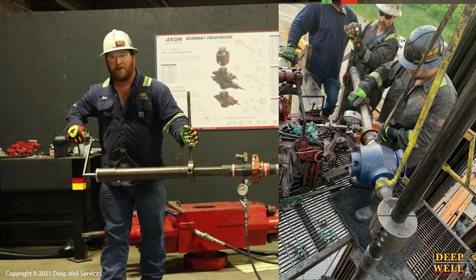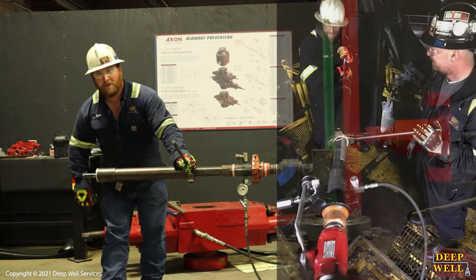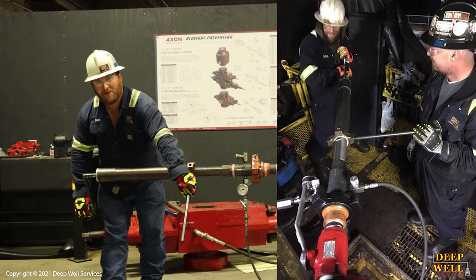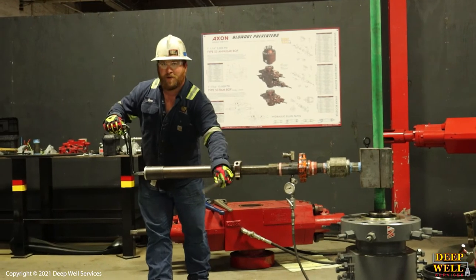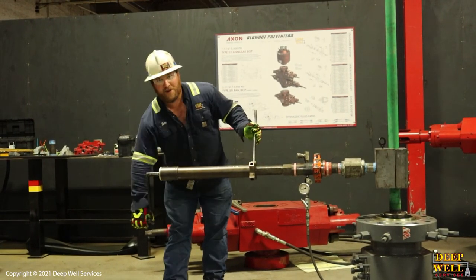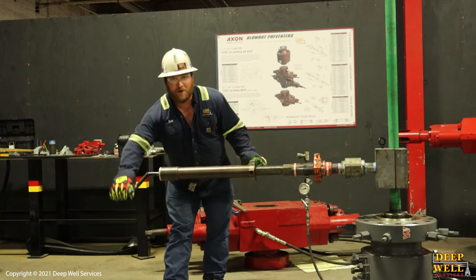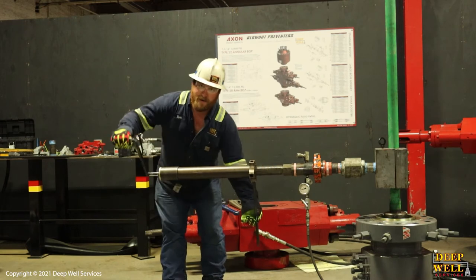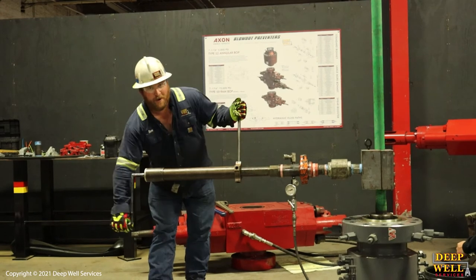For example: if I'm drilling nicely, I'll call 'give me some more' and the other person advances the drill. If the drill gets too tight, the person running the drill bit needs to call out to stop, and you want to back off before you start drilling again. You always turn to the right — you never go backwards. We're still drilling our joint and getting pretty far through it now, with our measurement getting close to the wall thickness spec.